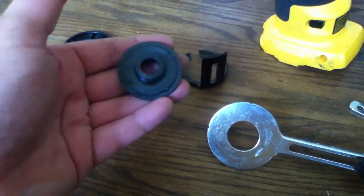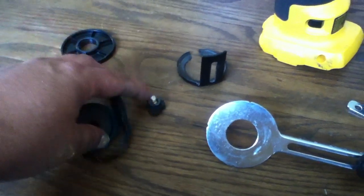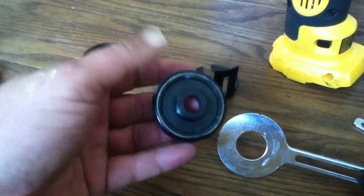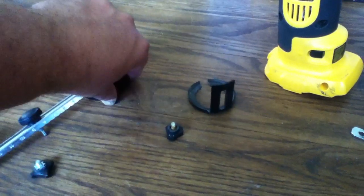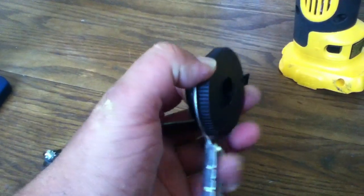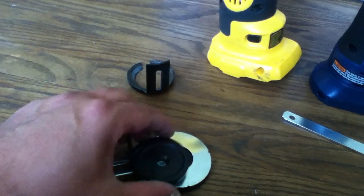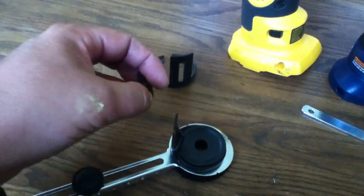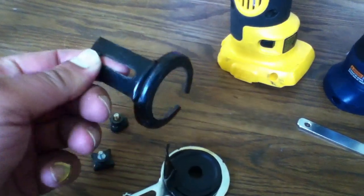The hole down the middle is the same between them. The DeWalt collar is a larger diameter, but the center hole is interchangeable. On the Sears Craftsman version and the Roto Zip version there are other attachments using this same basic system, but the most common and useful is the circle cutter. To set up the Ryobi with this attachment, you insert the piece, notice the little notches — rotate it until they click in. Then the rod goes through here. You put the lock ring on and tighten it down. It all screws together and self-centers. As long as you still have this piece from your DeWalt, you can also install this circle cutter on a DeWalt. A lot of those accessory types are relatively standardized.